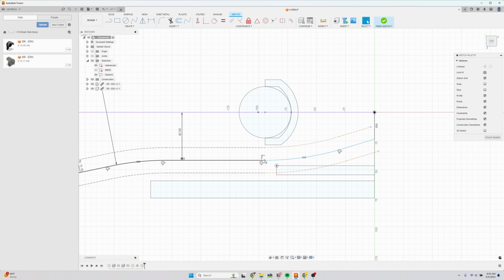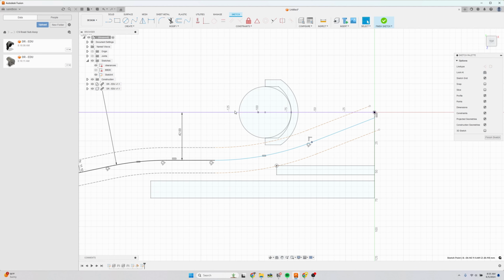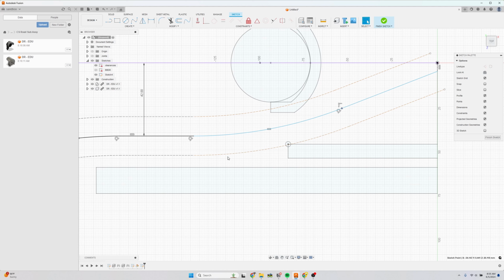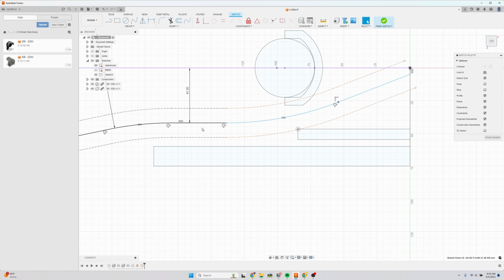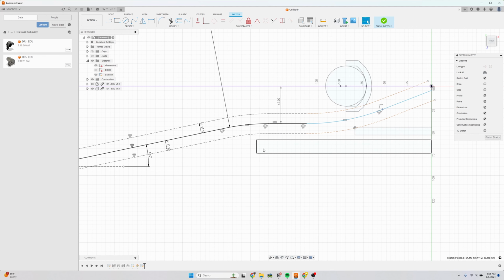And now we need to place this bend and this angle here. So this is where it gets a little hard. We're going to need to dimple the inside of this chainstay for this tire clearance, and we're going to want this to sweep across and just miss this clearance right here. Another complication is that for the Cobra chainstay bender, there's a minimum distance here that has to be satisfied. You can't have this distance between the S-bends shorter than 75 millimeters.